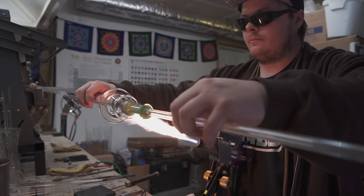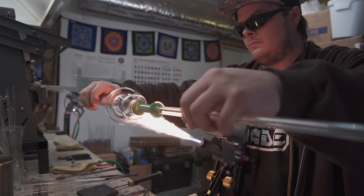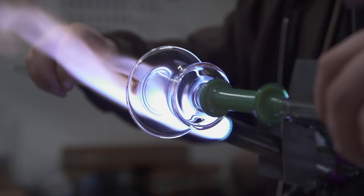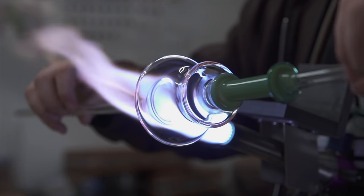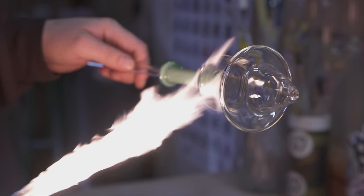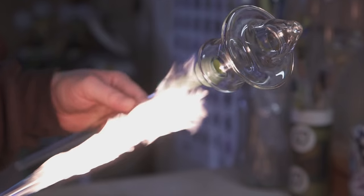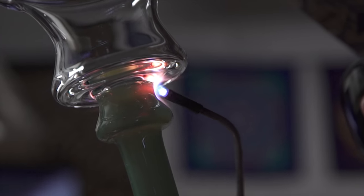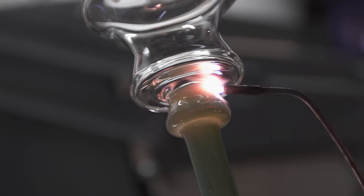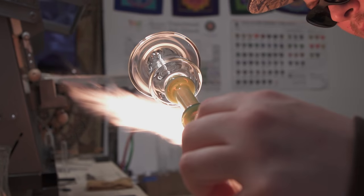Did, however, notice a little bit of divot or wrinkles on the surface there from when I was pushing that shoulder down. So after I remove this handle, I'll go back and polish that with my hand torch. It's really important to just make sure you do it in small quadrants so that you don't get the whole area hot and it wants to slump on you. It's also a good chance to look underneath the lip there and inside the can to check that weld.